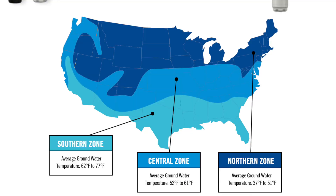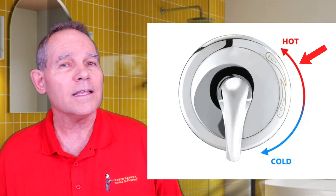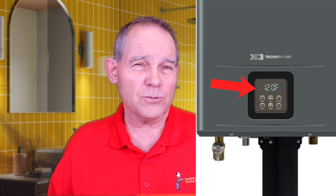Tankless water heaters are generally only seen in middle to southern states because they're strictly based on how much they can raise the incoming water temperature — and they have to do it instantly. Remember: tankless gives you endless hot water, not instant hot water. The water is heated instantly as it passes through, but it still takes time to reach your faucet. If it took two minutes with a tank, it still takes two minutes with a tankless — the difference is the tank runs out and the tankless does not. Tankless also runs at lower temperatures — typically 120 to 125°F versus 130 to 140°F for tank heaters.